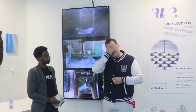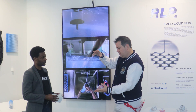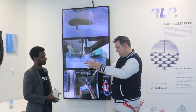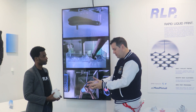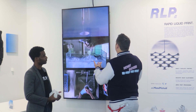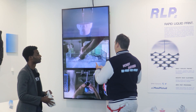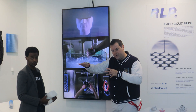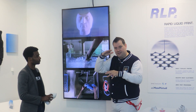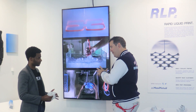Let's try to put that in terms that 3D printing people can understand. The closest technology I can think of is SLS — you have a vat of powder that you sinter with a laser, it requires no support because the rest of the powder acts as a suspension, and it means you can do new geometries and stack parts. But this is more than that, because this is non-planar printing — where you do not have to print in a straight layer. You're not printing in X, Y, and Z only; you're able to print really complex topographies which also require no support.